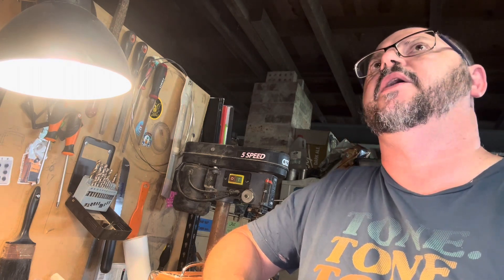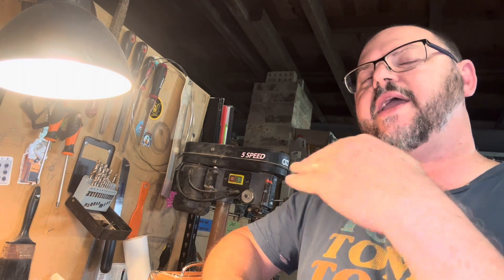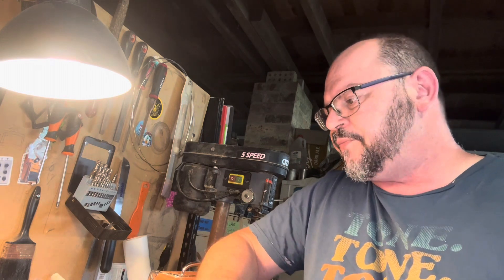250k is less prone to focusing on those high notes. If you think about a humbucker, it's got a wider pickup — the two coils are sitting wide apart — and it creates a wider space, so inherently it's usually going to be a thicker sounding pickup. Single coil pickups are thinner sounding. And piezos, I think, are in that same ballpark — that thinner sounding type of thing. So if you were going to use a tone pot, I would suggest a 250k with a 0.022 microfarad capacitor.